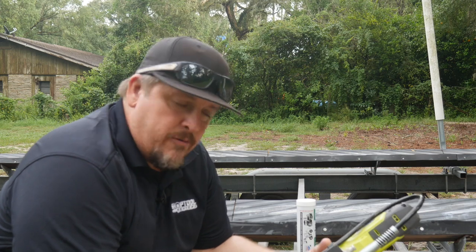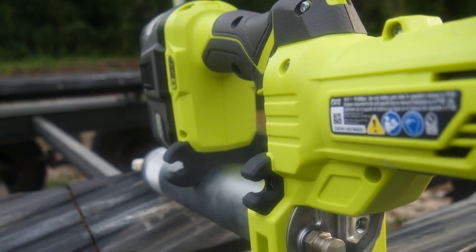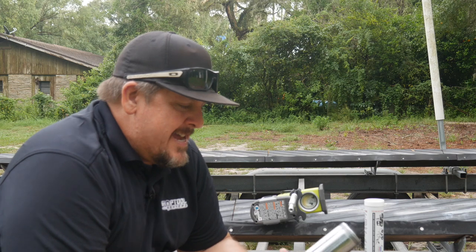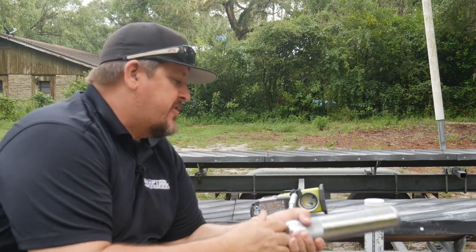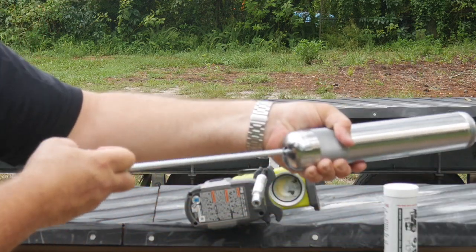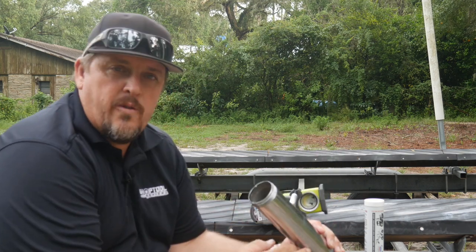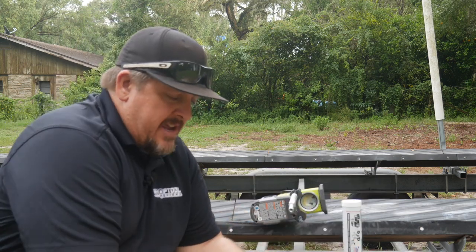Let's go over a couple of things about greasing. I've seen lots of people buy grease guns because they want to start greasing their own front ends, or they've got a boat and they need to grease those axles. They want to just slam the tube in there and go, but they really don't understand how these grease guns work. So I've pulled this tube off the gun like you should do when putting a tube in for the first time. I first should have pulled this out and locked it into place — you've got a little cam and a groove in the rod that you can slide over and lock into place. There's a spring in here.